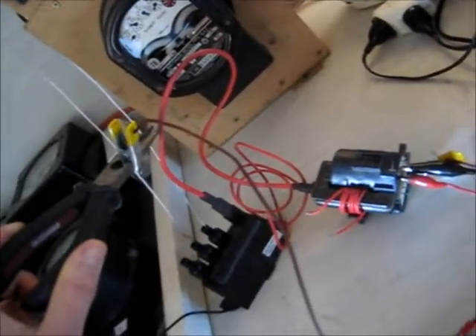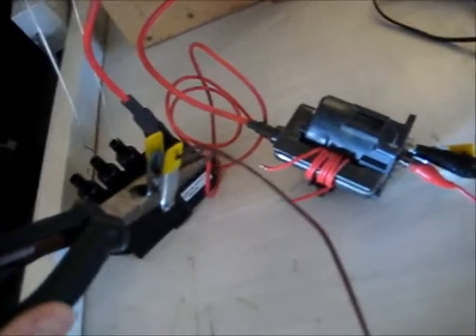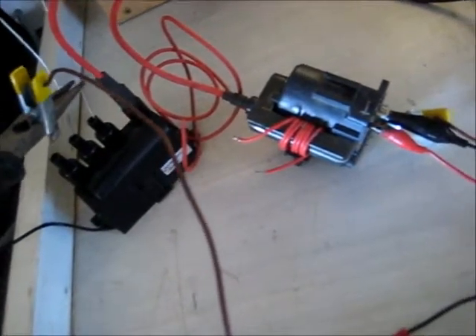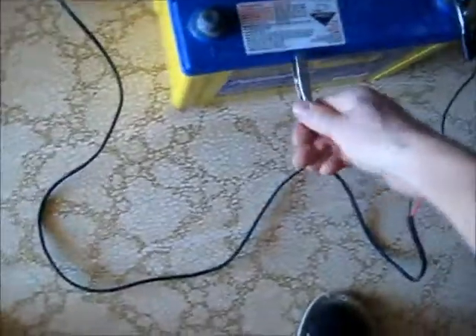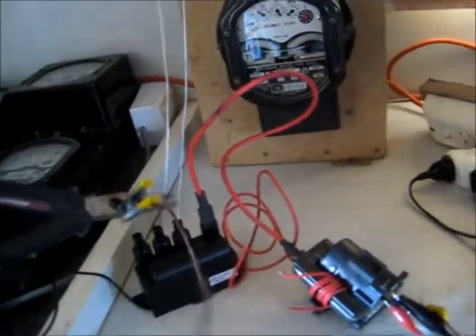That's insulating, so it's not enough to break the insulation on that. So I must be at least 40kV, because I think this is rated to 50kV. Then again I can hear static and corona, so I might be a little over 50kV going through this flyback. Just not the right frequency to really get anything spectacular. It's not quite performing as bold when it's straight off the end of this. Either way there's capacitance — you can hear it discharge. There are capacitors, and that must be the modern-day equivalent to one of these. It's capacitor-based. Except instead of going into one tube, it goes to three of them. There you go — you learn something every day.